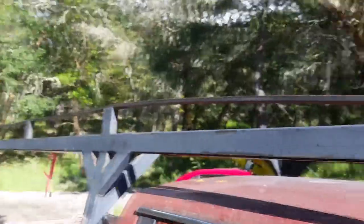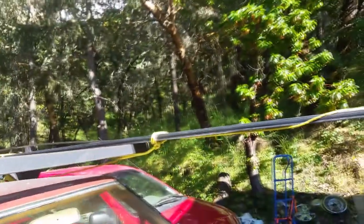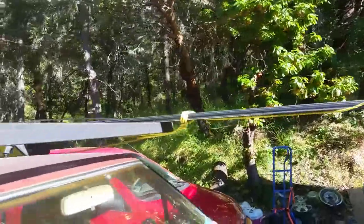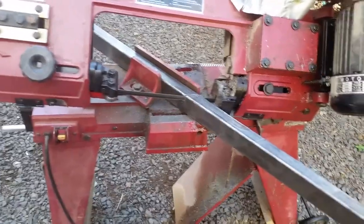It's the same stuff they made my lumber rack out of — I didn't make that, but it's the same stuff. These are 20 feet long, and I'm going to start off by making two rectangular frames. One is going to be the base and the other is going to be the top — kind of analogous to this part here. Some call it junk, I call it my Harbor Freight metal cutting bandsaw. I'm going to cut this in half at a 45-degree angle and I'm going to have four of these pieces when I'm done.